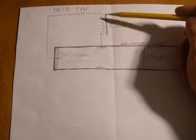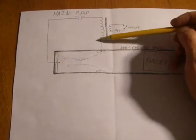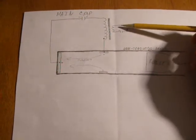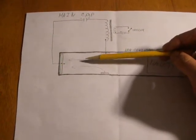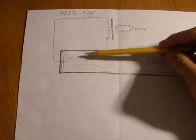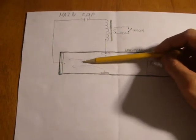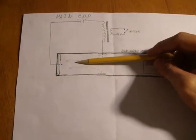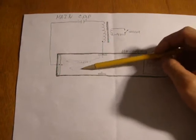In order to overcome the high voltage requirement, we add a transformer in series with the capacitor and electrodes, with the secondary connected in series with the electrodes, and the primary is discharged with a small cap and a trigger. The voltage is temporarily uplifted to a level high enough to ionize the air between the electrodes, which initiates a discharge. Once ions appear in the discharge chamber and current starts to flow, plasma is generated. To sustain the current flow, no more high voltage is required — even a couple hundred volts is enough.